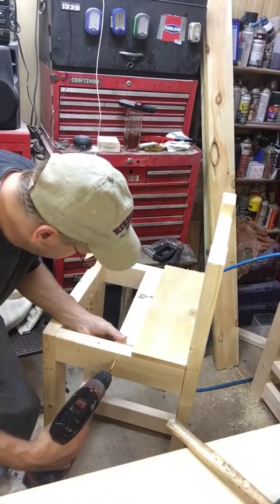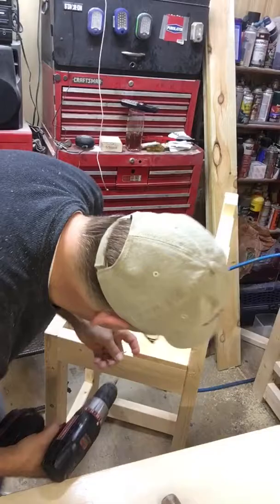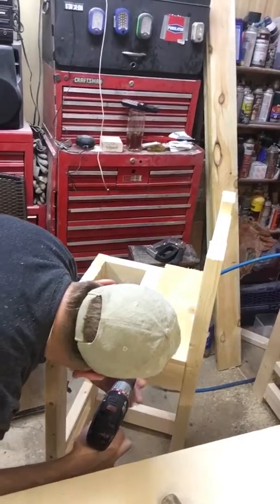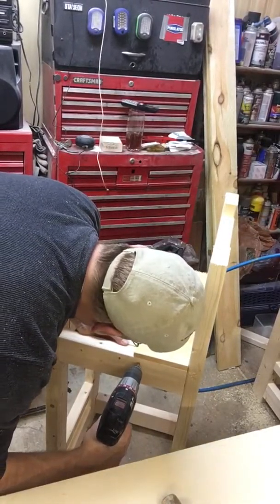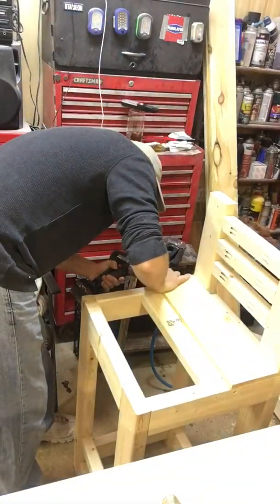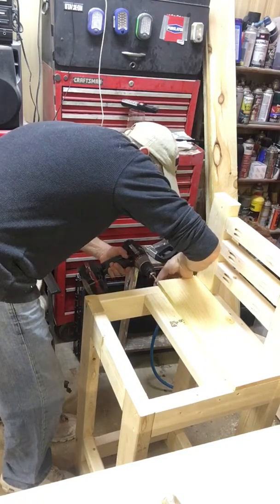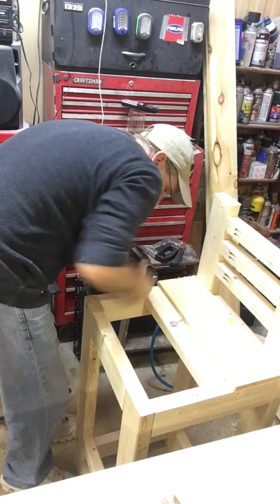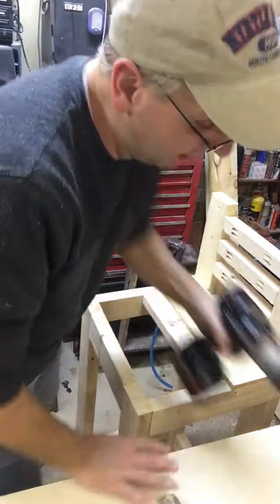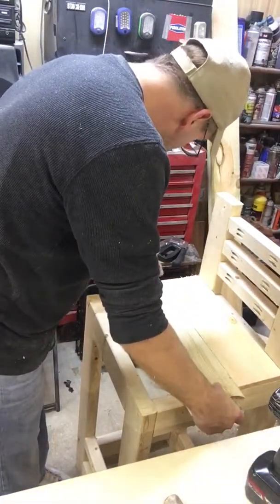Hopefully you guys can see this. Sink them just a little bit — this way you know it's gonna bite in, but don't go in too deep because it's not going to support the chair anymore once the hole is reamed out. Dig it in there about an eighth inch, it's gonna be all right. I don't like readjusting screws sometimes because it makes a hole and then you see it. You can put your hand there and feel the screw if you're not lined up — move your hand, if you don't it's gonna hurt.